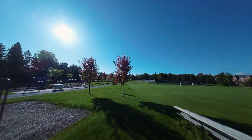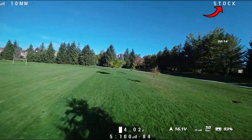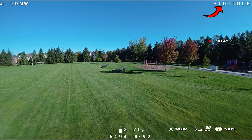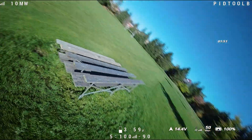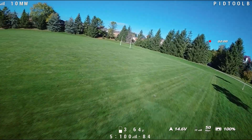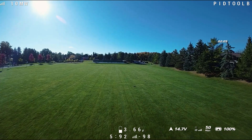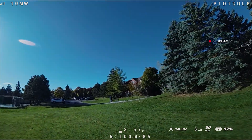I also did a full PID tune using the PID toolbox, which is the way I do all my PID tuning now. What you're seeing on screen is the PID tune I ultimately landed on — I'll give you a link in the description to a video of how I do my PID tuning. I also tried the stock Betaflight 4.4 tune, which flew quite well, although you can see the occasional wobble or twitch. I found the PID toolbox tune was more stable and less twitchy. Based on my style of flying, which is mild freestyle, I got a consistent three and a half minutes of flight on each pack — a little on the lower side. I typically get about four to four and a half minutes on my three inch, but being smaller and a little heavier, three and a half minutes is not bad.